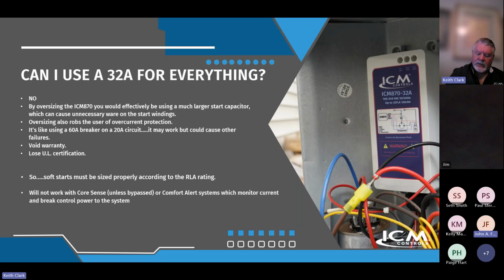Yeah. Let me talk on that for you, because that one's a complicated one. So thank you for bringing that up as well. Some of these models, air conditioners, Goodman, Nordyne, Rheem, but the one that's the most problematic for us is probably the Goodman, that have a circuit board based, what they call the Comfort Alert system. It's a system monitoring system that monitors pressure switches and whatnot, but it also monitors current on the run winding. It's meant to be a monitoring alert system to monitor the functions and shut down the AC unit if it sees a problem.